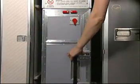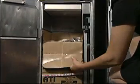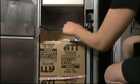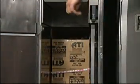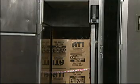At this point, open the main door. Fold over the end flap of the box. This will prevent any small bits of trash from falling out of the box when it is moved into the aft compartment of the compactor. Pull up on the mid-door release handle that unlocks the mid-door. With your foot, push back the full trash box into the aft stowage compartment of the compactor.